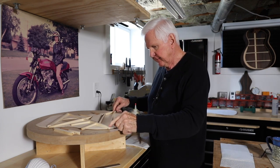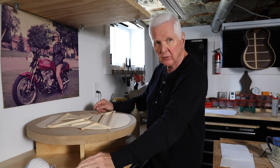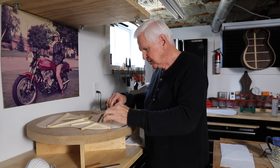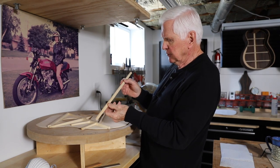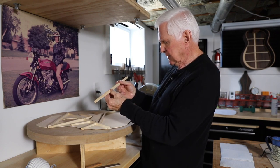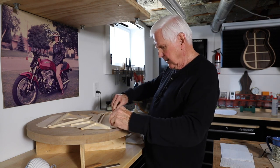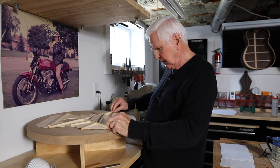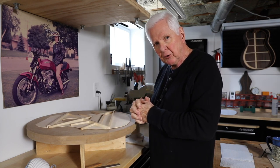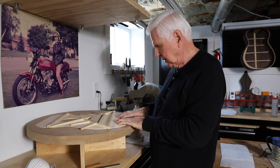While we were gone I cut off the end pieces that we had sticking out here, and I took the cutoff pieces and those I'll just throw out of the way. Now I have taken all the bars and measured the very center part. Because they had a radius on them, I wanted to be at the center, and I want that center to come down the center seam of the guitar. So I have measured each piece and marked it so that when it lines up, it lines up exactly with the center of the curvature and the center of the guitar top.